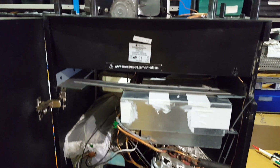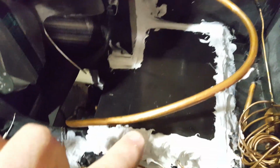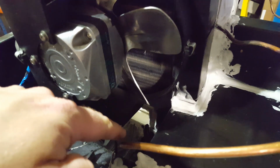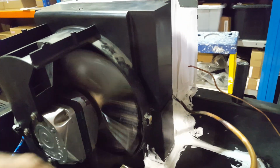And then up the top here, I'm just working on the evaporator. I'm just working on some panels to seal the airflow between the top and the bottom, because we can't exactly have these big holes here. Otherwise, hot air is gonna get drawn up into where we want the cold air. And that would be like a heat short circuit. We don't want that.